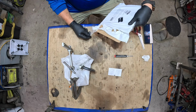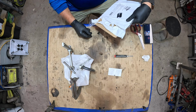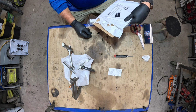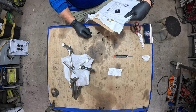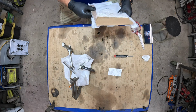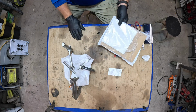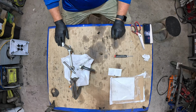And this is from Lynn Manufacturing Company. Universal gasket paper product is a high temperature gasket paper rated to 2100 degrees. Soft, pliable material used to cut your own gasket. I think this would probably work on its own, but it's kind of like the first little leak that you would have, it would kind of blow the fibers out.